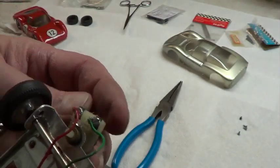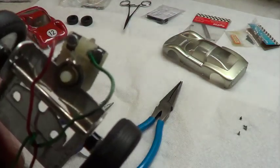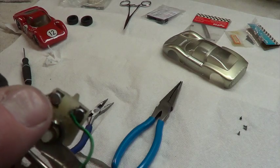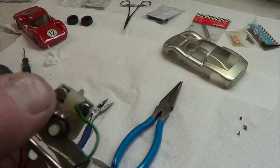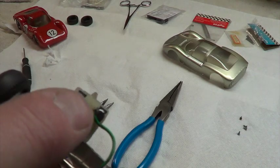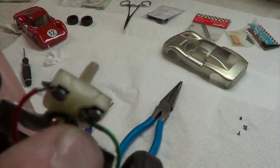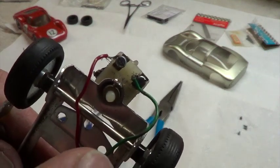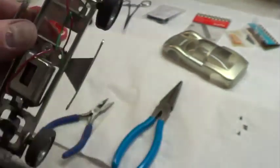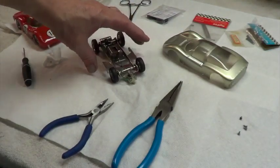As I said, the guide and brush carrier is very similar, but there are some key differences. The wires actually just form a hoop. They don't have ends on them. They're just bare-ended. You form a hoop, and you let the screw that screws through the brush also crimp down the wire up against the guide. So they're a little different, a little more time consuming to get in there. And again, I'm going to do it on the inboard here.